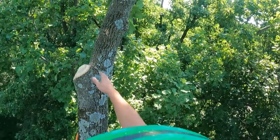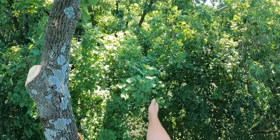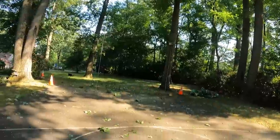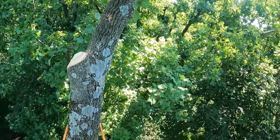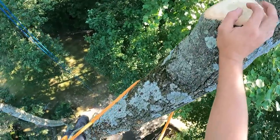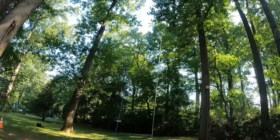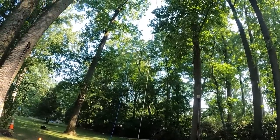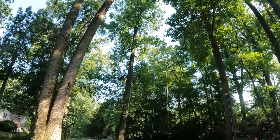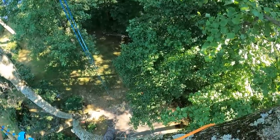I say I tie it on and we just put it in that tree and then yard it out. I think that's... Okay. We'll do it. I think it's the least bad option, kind of. I don't think that we have many good options with it because it just leans so hard and it's so long. Yeah, because it goes out so far that a hinge is not going to do anything. Yeah, I'm not going to be able to manipulate it anywhere. Yeah, so I'll just take the rigging line.